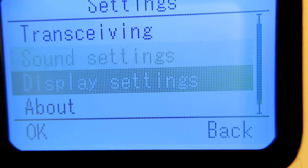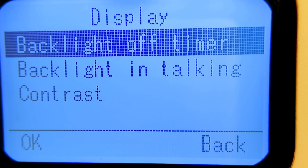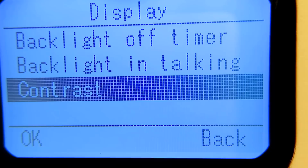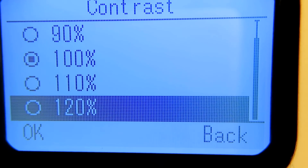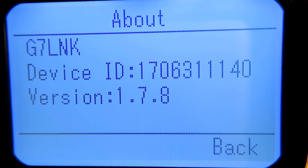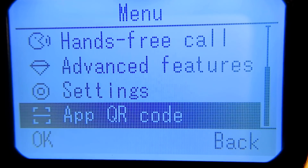You won't be able to use these radios on PMR because the frequency steps are 25kHz, so you're not going to get onto PMR with these radios unless they change the firmware. It's got very similar settings to what you find in other radios, but this is definitely not based on the Baofeng UV5R menu. This is very bespoke software for a radio. So it's fully featured, it's a really nice clear display as well. Again, this radio is £30 — £30 delivered to the UK. And I think it probably represents one of the best value for money radios that I've tested.